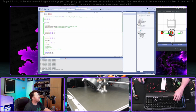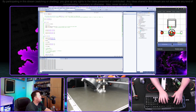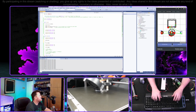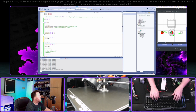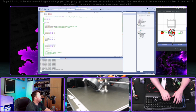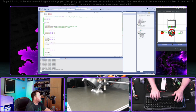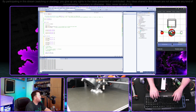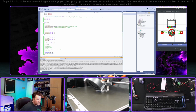All right, we'll keep that up just in case we need it. I wanted to pick a couple that actually have PWM on them as well. Let's do this as well. Well, let's start with both of them. Okay, here's what we're doing. Go 1,000, then we turn it off, and then we'll delay 500, so half a second. And just do it again in the other direction. And then we'll print out frame and increase it. Give that a shot.